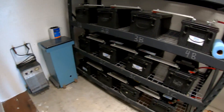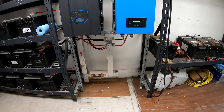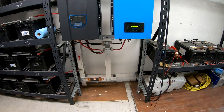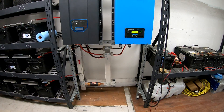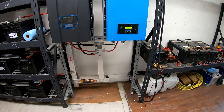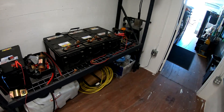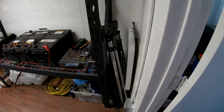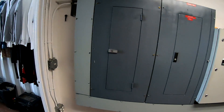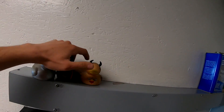I'm not doing the well pump transformer work immediately, but I'll have the provisions for it. The bus bar is going to come out — I may use the same 300-amp fuse, but one thing I'll need for those lithium iron phosphates is some current-limiting device due to their very low internal resistance. It's a silicon piece — I don't remember the exact details but you'll see in the next couple of weeks' video. Once the batteries are out, this rack comes out and I'll have better storage space.